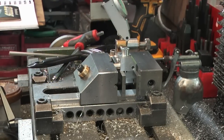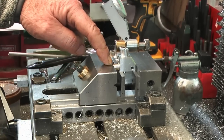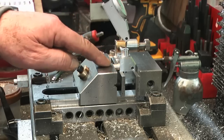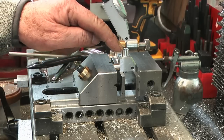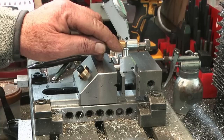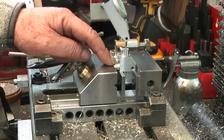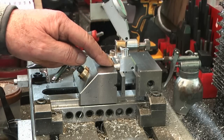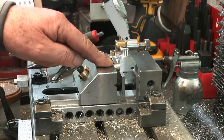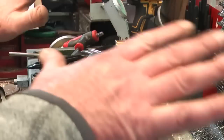I'm going to leave it in this state when I drill the cross hole, because it gives me more possibilities of holding rather than having a turned-down bit with a shoulder — just so I can hold it easy, you'll see what I mean. I've clocked up and put the part back in the vice, using the moving vice jaw to clamp the brass spindle for the throttle so it can't rotate. I'm going to pick up on that hole, double-check it by putting a 4mm reamer back up and just make sure it all lines up nicely. Once I've done that, I'm going to put a 3mm milling cutter — I've got some long ones — down through the hole and put the hole through the brass bush.